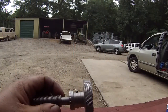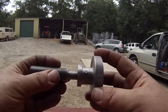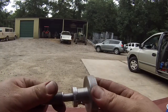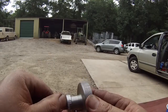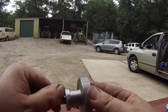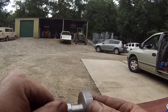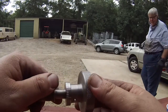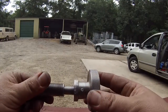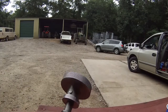I was trying to give you a better shot. Here's the wheel, the handle, I mean, that I just machined the divisions on for them. And like I pointed out, I did have one mess up right there. You see I've got the 2 long lines together. I counted ahead, and when I was on my 4th shorty, I went all the way across when I should have went halfway. But I think it turned out pretty good. That looks great. Thank you. That's it.